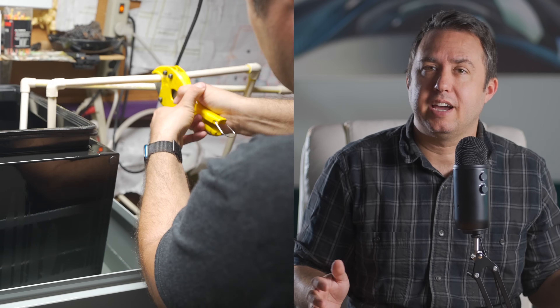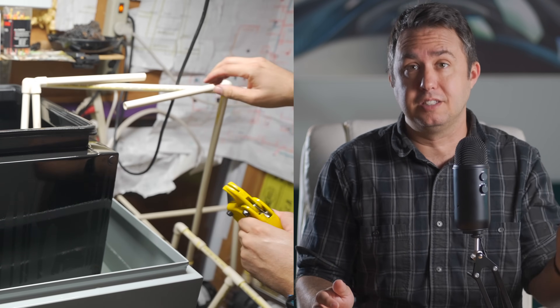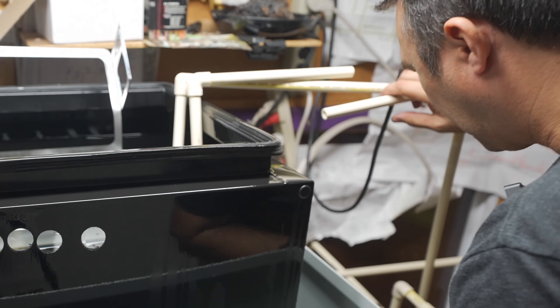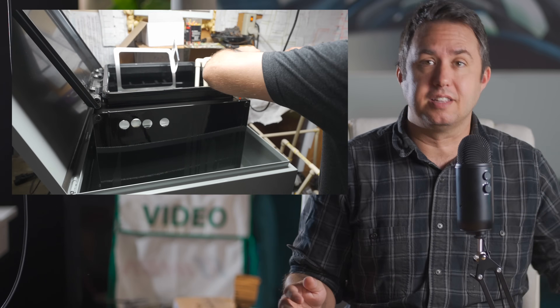Even though the pump is lower than the tank so naturally the liquid should find its way down, since the whole system was closed to the air, it goes back through the radiator and then down into the bottom of the tank — there was nowhere for the air to escape, and the pump couldn't prime. I cut the pipe at its highest point to allow the air to escape, and then in a very unnecessary step that I will never repeat and please don't do this at home — wow, is that PVC glue a strong taste and smell. I might have knocked a month off my life with that move. But upon turning it back on, we have flow. I slapped that line back together and did the same thing with the pool loop, and everything was pumping perfectly.